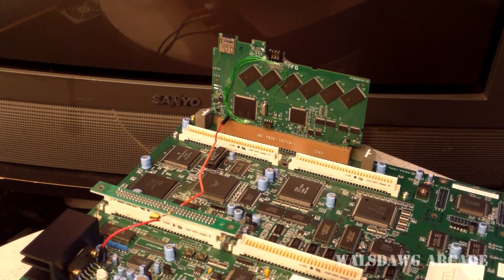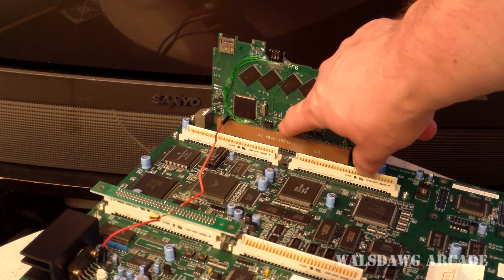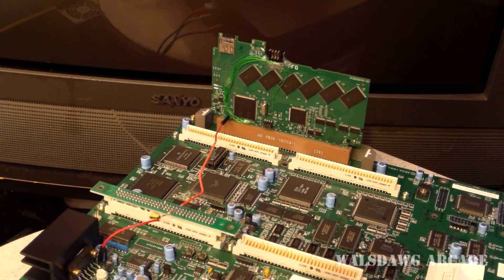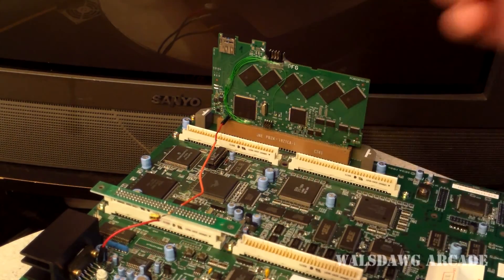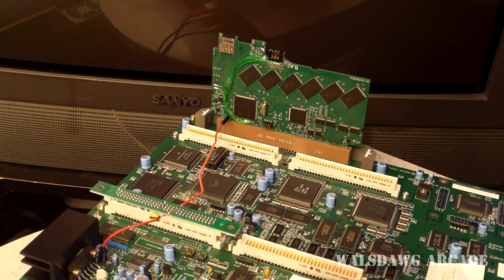Since you won't be able to see the LEDs that come on when it's changing the game, you can add this wire and then the sounds will play through the speakers because it's connected to your PCB. So the start and stop sounds will play through your speakers, so you'll know if it's loading a new game and when it's finished.